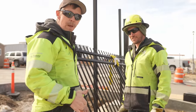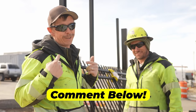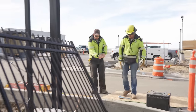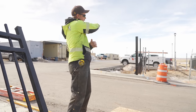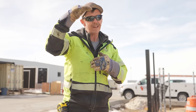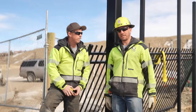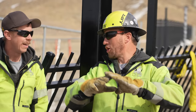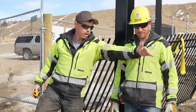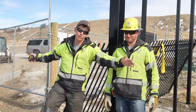Our way might be confusing - maybe you have a better way, feel free to tell us. We know we're downhill this way and it looks like we're downhill that way as well. These gates are square, so that means the gate is potentially going to be higher up off the curb if we go flat across this opening. We need to decide whether or not we need to step the gates. I'd rather not step them, but if it's a big change we're going to have to. Gate location is a huge factor - if the fence were five feet further up, we could swing the gate out and not have to do all this uphill swinging.